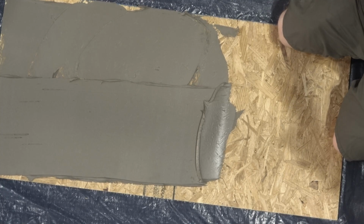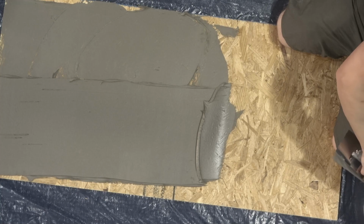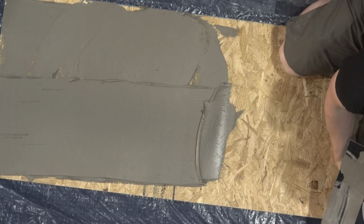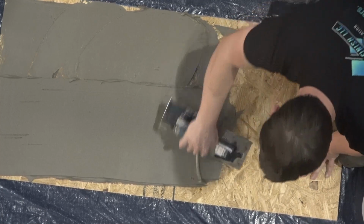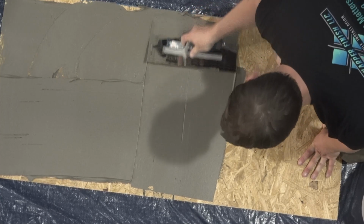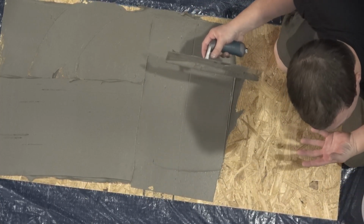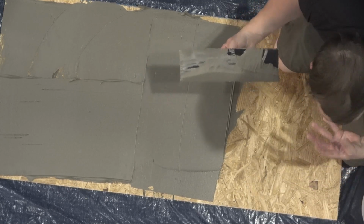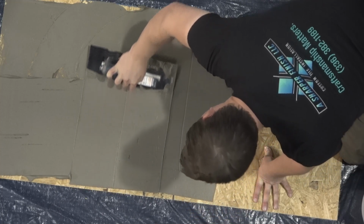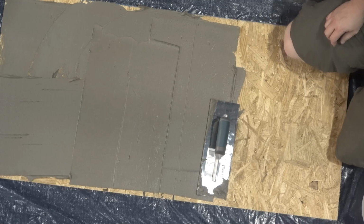The other thing, and this is a great way to position it, be able to save money with this particular product, is that because it can take 100% relative humidity, it can go underneath a moisture mitigation system. So instead of filling up nooks and crannies and divots with a very expensive epoxy that's $150 a gallon or whatever it may be, you're filling all that space with a much more cost-effective product.